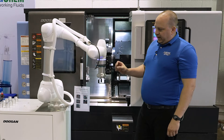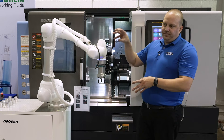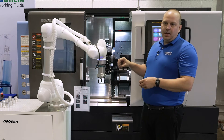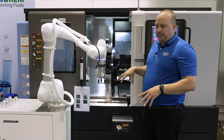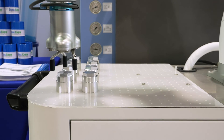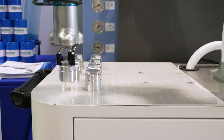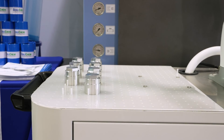This Cobot is designed with pallet modes. You touch off the four corners of where the pallet parts are, tell it how many pieces you have, and it will automatically calculate the pallet sizes. You can save those, and every time your job comes up you can refer back to it and get the program running very simply and quickly.